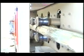The cutting head is located between the last in-feed and the first out-feed rolls. The hollow rotating head has three adjustable knife blocks. Each knife block has one roughing knife and one finished knife, for a total of three roughing knives and three finished knives.